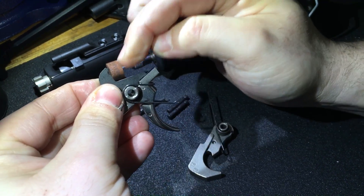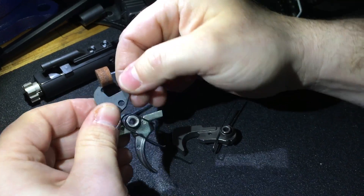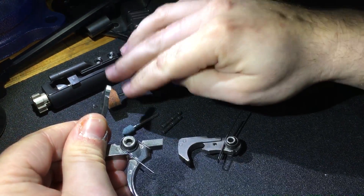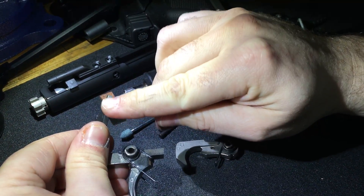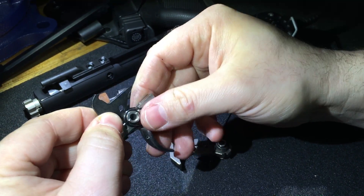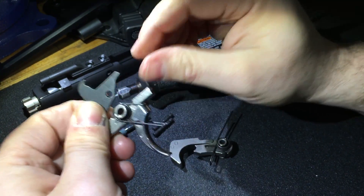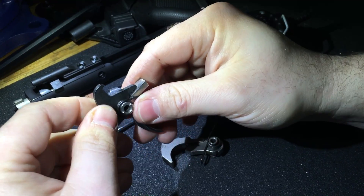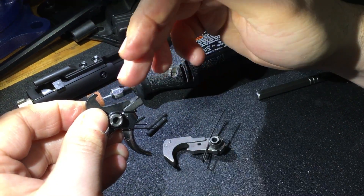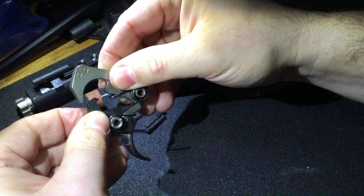Just file a little bit off of there, or grind it with a Dremel — a lot of people advise against Dremels but I just dremeled it a little bit. I assembled my trigger back in the gun and tested for function — it was still too big of a gap, firing on pull and also on release. I took the trigger back out, filed a little bit more off, put it all back together, and now it's working perfectly — getting a positive reset when I let off the trigger, going right back onto the sear.